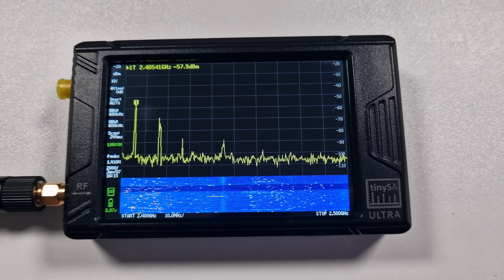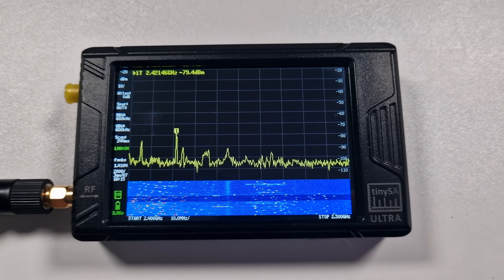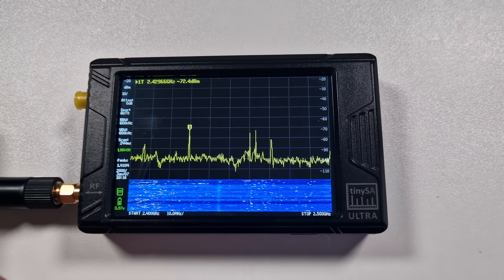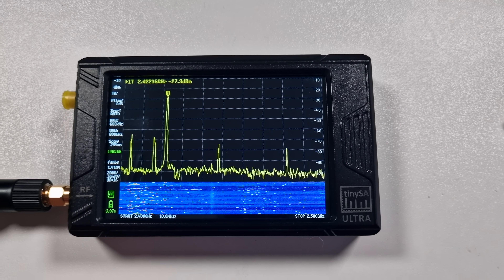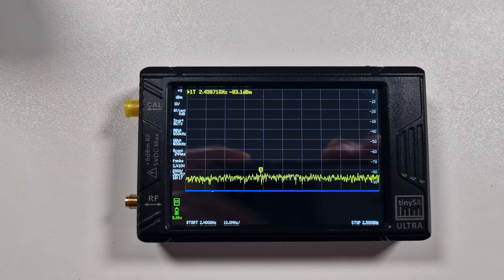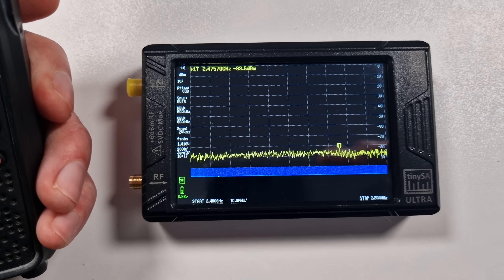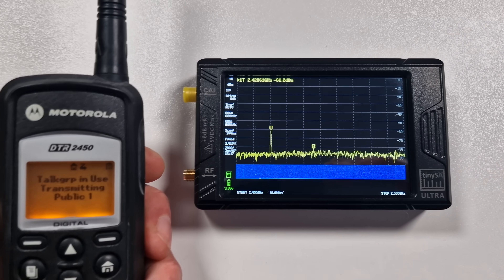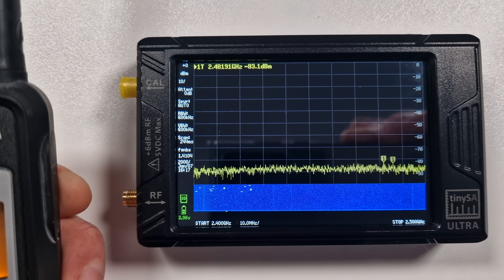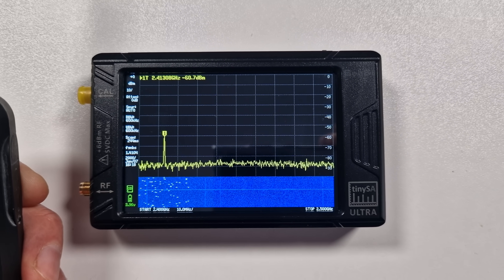There are a couple more red pulses in there which you can see, but that's only because I'm obviously very close to the antenna. And then if we release the PTT, it sort of goes back to normal. There are some red ones in there because I'm near some of my other Wi-Fi devices — basically anything that's on 2.4 gig. So you can see these radios are very difficult to detect because you just can't see where the signals are. They're just all over the place. And if we take the antenna off and turn the low noise amplifier off, just so that it doesn't pick up any Wi-Fi signals in the vicinity, it's pretty clean. So now when we transmit, you'll see that is what it looks like — it's kind of all over the place. And that is because the system is called frequency hopping spread spectrum.